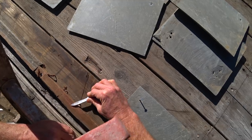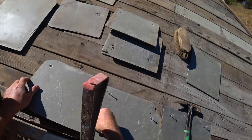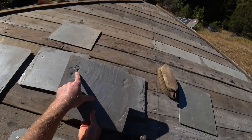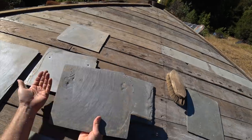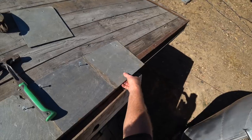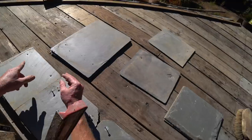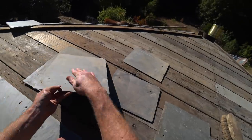I think I just left a high spot on the cant strip here - uneven wood, uneven slate. That's much better. You can see this slate I've hung and removed a couple of times. What I could do is put it on this side - it matches up real good right here. I'll put a little bit thicker slate on that end and test it. This is nice and flat, it looks just great.